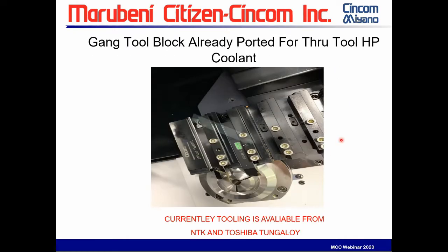The gang tool block is already ported for through-tool high pressure coolant, so you can mount some tools that run right through the tool spindles. So far, NTK and Toshiba Tungaloy are the two manufacturers that make tooling to accommodate this. We're working with some other manufacturers to provide tooling that allows through coolant right off the gang plate, so you don't have to have the manifold block here to get your high pressure coolant through the tools.